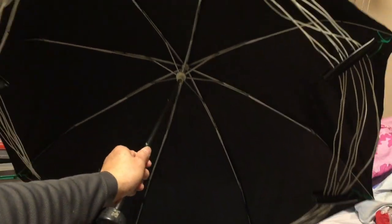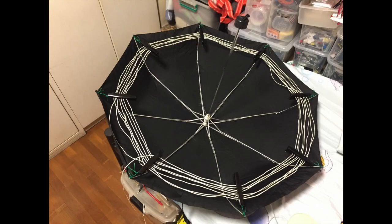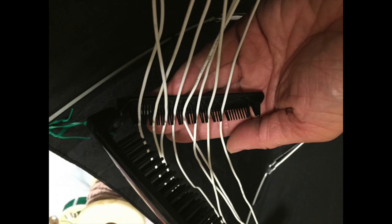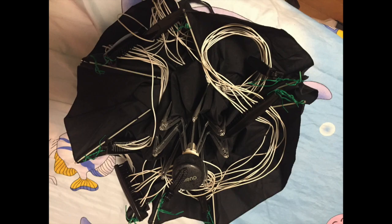We can stand the umbrella up — it's quite stable. The umbrella diameter is around 0.8 meter, so it's very good for receiving radio waves. The turns need to be evenly distributed, which you can do by counting the teeth in the comb — every two or three teeth you can place a wire. You can also close and shrink the umbrella, put it in your backpack, and it's ready for your next field trip.